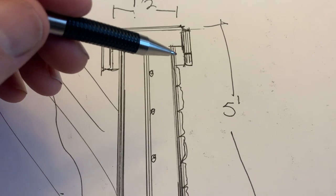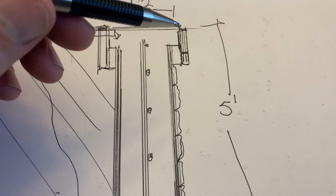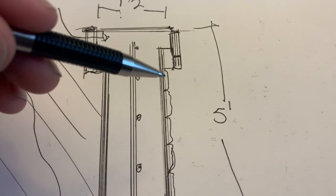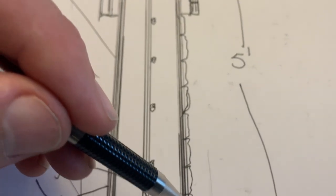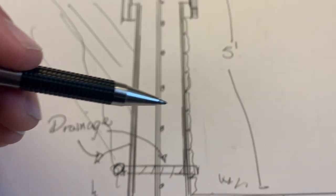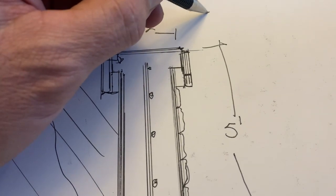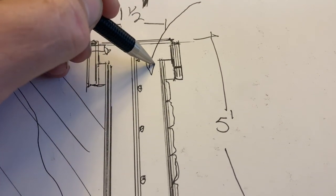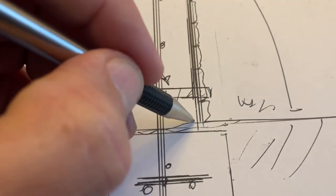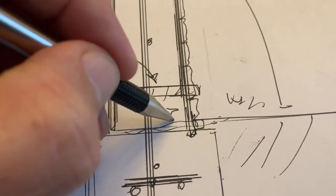We did a block of wood here, or a piece of 2x4 in here, then a 2x6 over here that bit into that and came across all the way to here. Now you have a capstone here. This is the panel that you tie into here, and this already has the rock form. So you don't need a form liner, you don't need to carve it, you don't need to learn how to carve or anything like that. And then of course, the concrete's gonna come into here and fill this up. You can have the footer first and wet set your panel into here, and that way you don't have a blowout this way, okay?